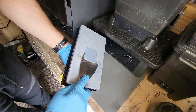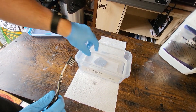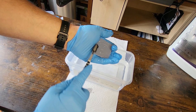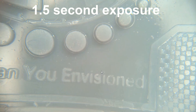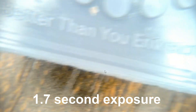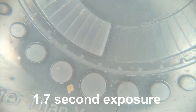Here is the result after about 15 minutes of printing. It seems to have printed OK and it's come off the build plate OK, no problem. I'm going to clean it in the detergent. Under the macro lens you can see it's underexposed — some of the words haven't come out properly and it's failed a little bit. So we're going to up it to 1.7 seconds. The second one is much better; I'm happy with 1.7. The centre part looks a lot better as well — it wasn't completely formed at 1.5 seconds. I'm going to run with 1.7 seconds on this resin.